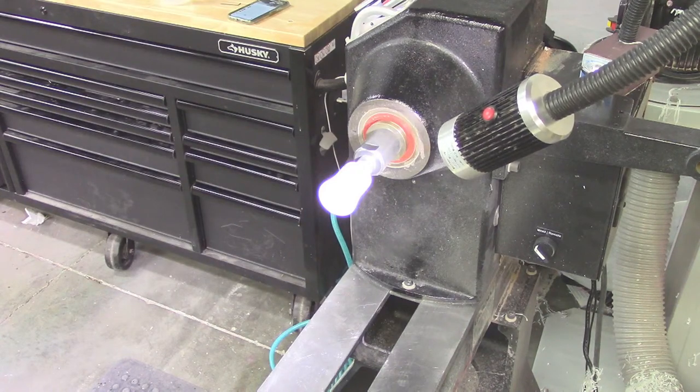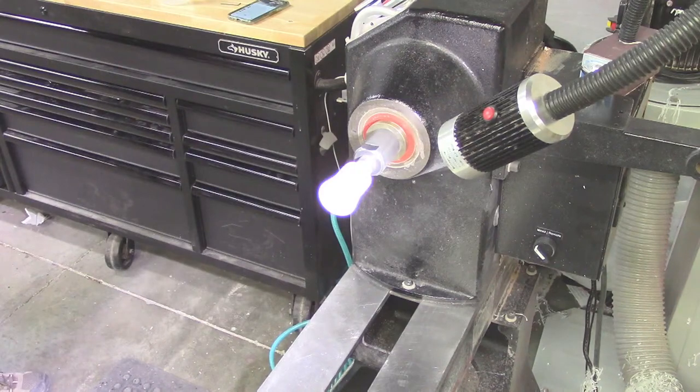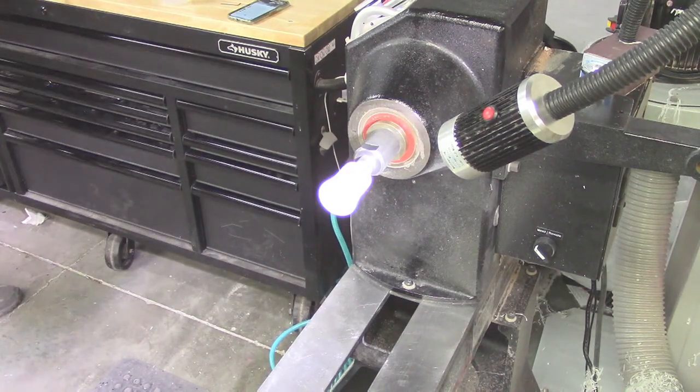I think, especially for a piece like this, we'll use a little bit of water and then dry it off, and then I'm going to switch to the sanding paste, the Triple E Ultra Shine. And I think we'll be good. That'll put some oil and life back into the wood. We only need to wet sand with maybe two grits. Actually, let me think about this. The whole point is to use that stuff. So let's see if we can just go to 600, because that's kind of what they say. You can go to 600. I would rather go to 1,000. Let's just do that. I don't believe the 600 propaganda. So let's just dry sand up to 1,000 and see what we get with the Triple E Ultra Shine stuff.